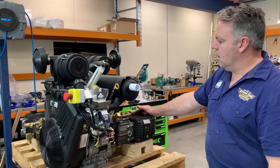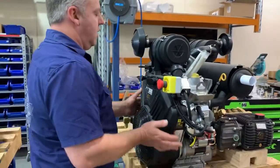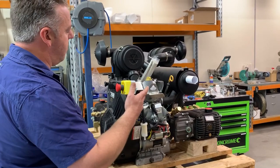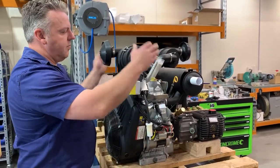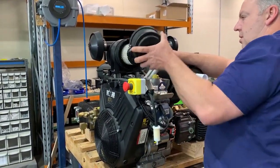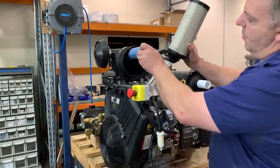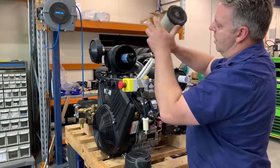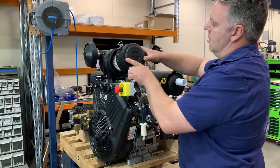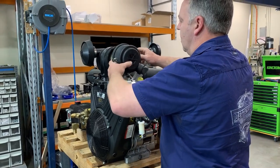This has been a good engine over the years. For servicing, there's engine oil and an oil filter, fuel filters, a fuel pump tap and adjustment. They run a Donaldson air filter — a two-stage system with a main air filter and an inner filter. As far as getting clean air to the engine, I would say this is a superior system over Honda, however it sits up a lot higher, so the machine can't be as compact.